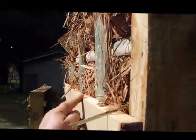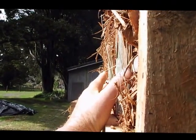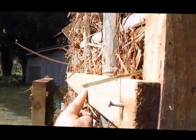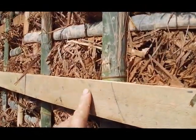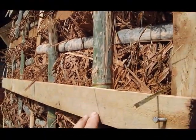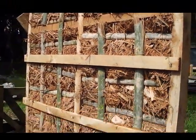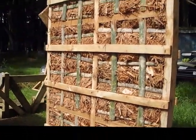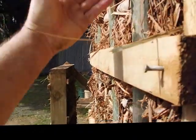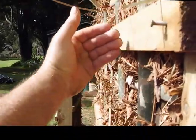That'll give us an inch thick heavy fibred clay that is heavy in fibres, and then we'll probably have to put some hessian, scrim, whatever you want to call it. Plasters do not stick to wood. You have to nail something rough over them. Chicken wire, hessian, whatever you got on hand. And then you could even have another inch. As guides for our screeding off, we could put some 1-inch battens going vertical.